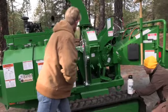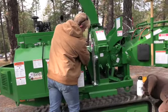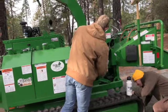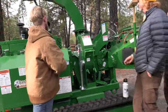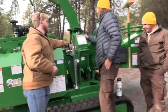After that, guys, that about wraps us up. Before I get ahead of myself, you do have another daily grease point here. Run into that bearing there. And then we touch on that one over there. Well, actually, Pat, we may want to. So there is a daily bearing that's going to be underneath this door. All right, so we got that.